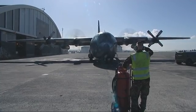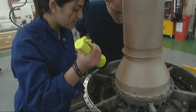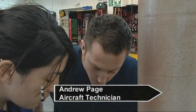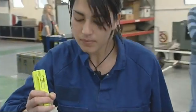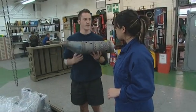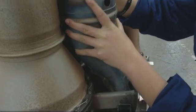After having experienced the power of the engine, Payton gets to inspect the hot end of an engine turbine in the engine bay. See those little holes there? They generally crack around there because that's where the hot air and the cold air meet, so we'd be looking for cracks or anything missing. This is the combustion can — by the name of it, that's where the ignition goes on. When we do our maintenance on the engines, we're basically doing inspections, servicings, removing filters, removing components.